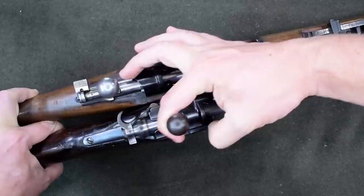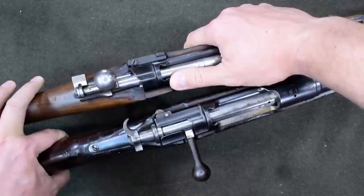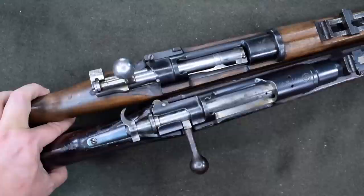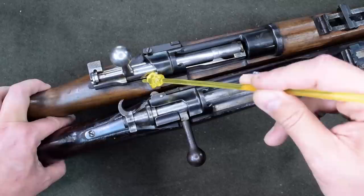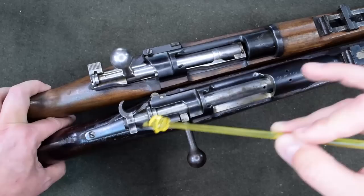Another feature that I can't show you at the moment on the Mauser is that on a 95 Mauser, we would have had a metal extension here with a little rise that would sit behind the root of the bolt handle and act as an additional safety locking surface. The Arisaka has just that, which would have been on a 95 Mauser, although very low. It would have been all of a quarter inch tall. In this case, they went way up and over. This provides a little extra leverage.